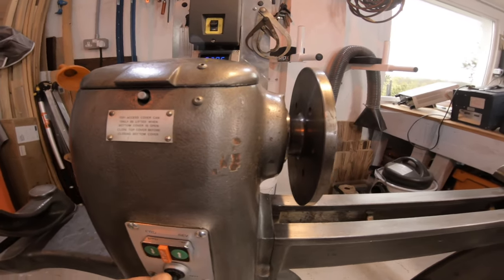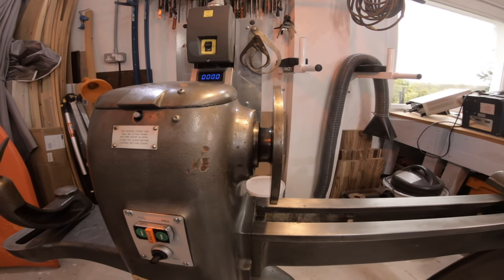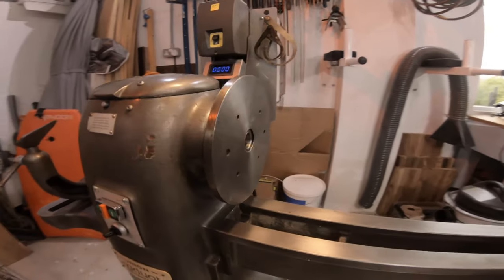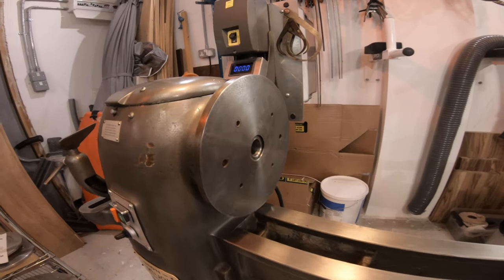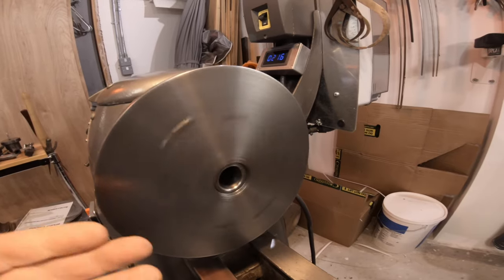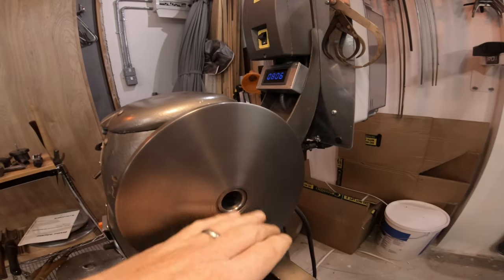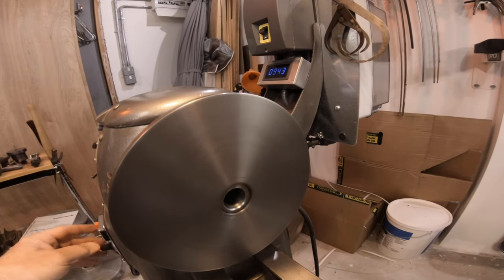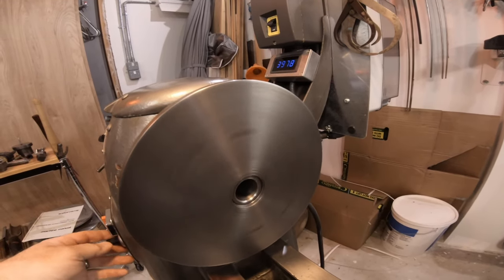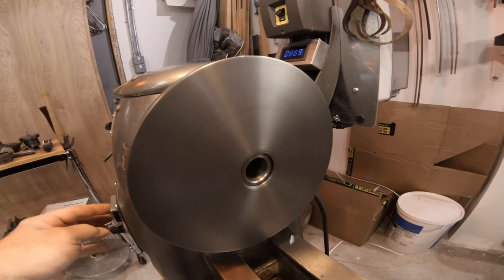Having reverse is such a useful thing for sanding. Obviously you don't turn anything in reverse, but if you run it in reverse you can actually sand all those nibs and de-nib your wood, then just stop it and go the other way. Very useful.